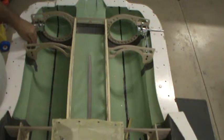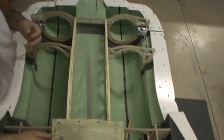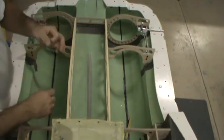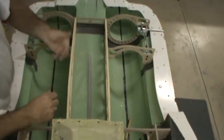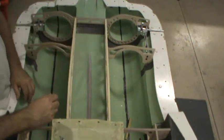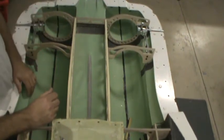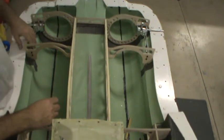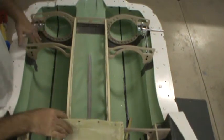Another thing I'm going to do is do away with the rubber grommets on the servos. I'm going to replace them with some machined aluminum grommets that I've got to draw the CAD for and get some quotes on. Basically it'll just be a little aluminum two-step washer — the smaller step fits where the servo screw flanges sit, and the two-step portion overlaps as a washer surface. It'll be for a 4-40 machine bolt with lock nuts on both sides. Aluminum grommets basically get rid of any chance of slop in the horizontal stab, rudder, or any system you use them in.